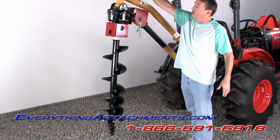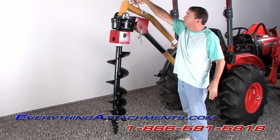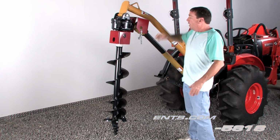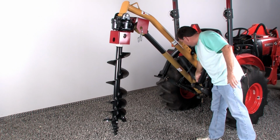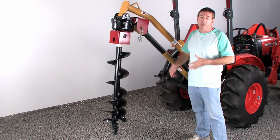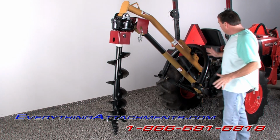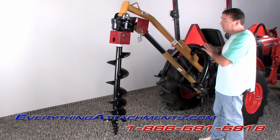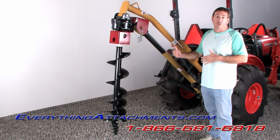We have a nice hook here that makes a good way to unhook if you've got a place under a shed or something to put a strap through. It's a pretty good way of taking these off. Don't forget to hook up your safety chains so your shield isn't turning top and bottom. That's your standard 1 3/8 PTO that's on a BX, the B, and any full-size tractor. So we just wanted to point out how well the compact fits on this category 1 size tractor of any brand. And we've also got this shown on a BX with our small one.